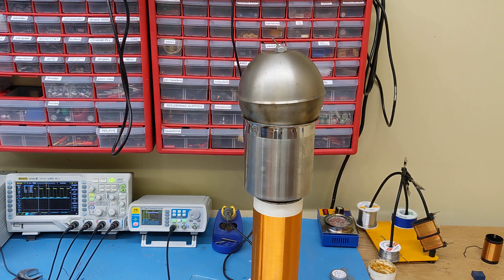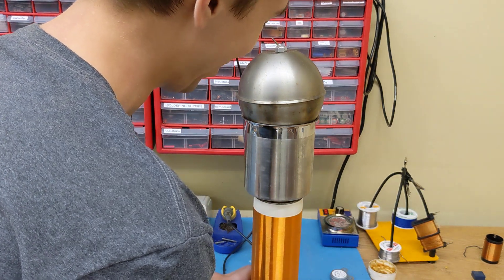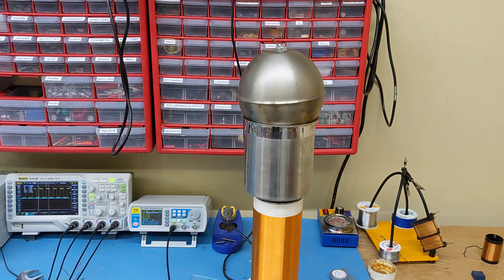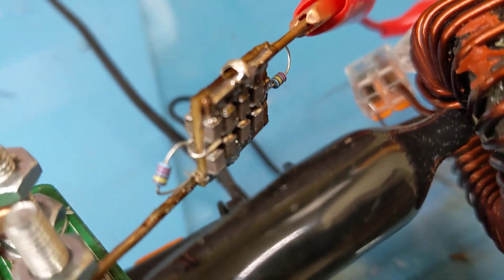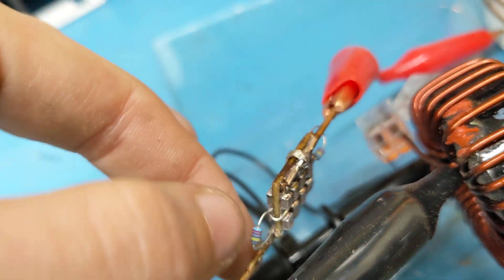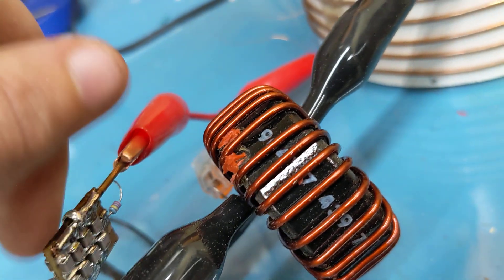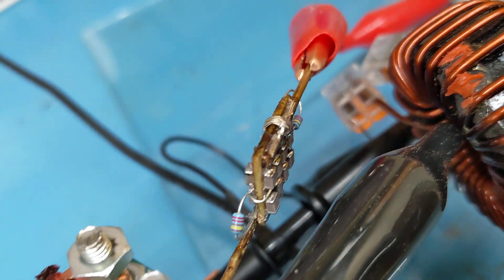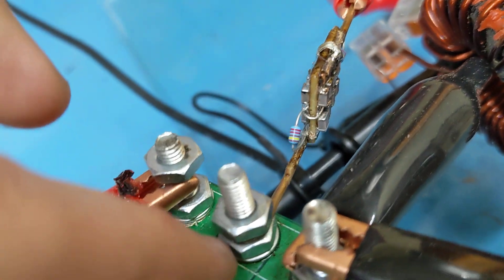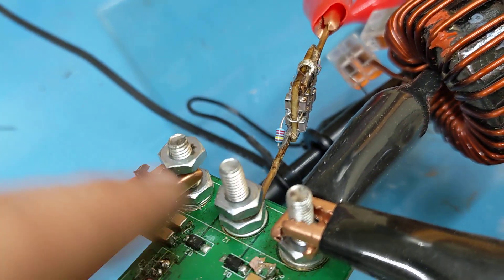Let's turn this off. The power supply is pretty warm. Secondary coil: warm. Primary is very warm. Check this out — this is my primary. This is a dual resonant Tesla coil design, continuous wave, and I'm just using these little itty-bitty, teeny-tiny ceramic capacitors. They're not even warm! Well, okay, they're really hot because this bolt is getting really hot. This bolt is the bottleneck — it's made of steel, and the skin effect means the electricity is traveling through the skin of the steel rather than through it. So these bolts are a bad idea; I'm gonna have to change the design up a bit.